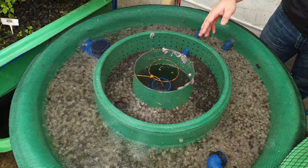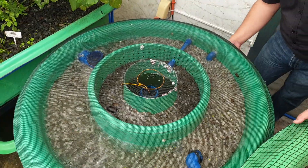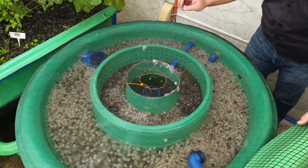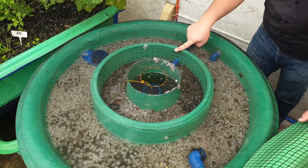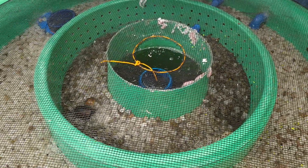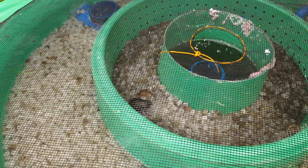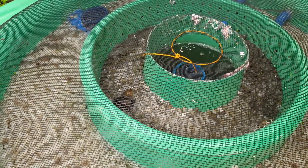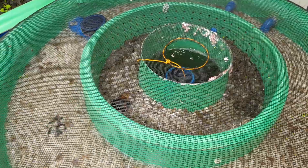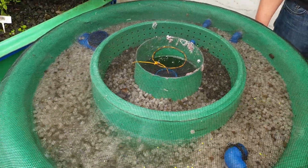Before we go to the plants — a while ago we cleaned the filter. To clean it, we simply divert the air from the moving bed to the static bed. By doing that you agitate the static bed and get rid of all the muck inside it. We then let that sit for five minutes and drain the filter. Let's go to the drain.